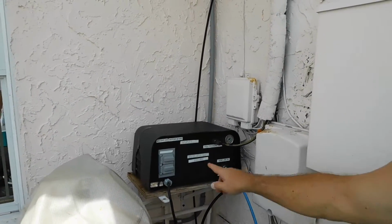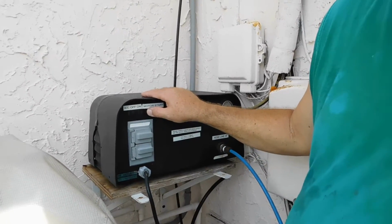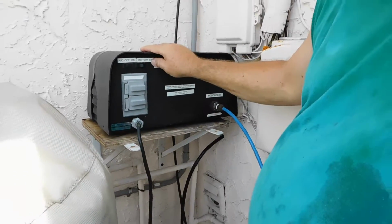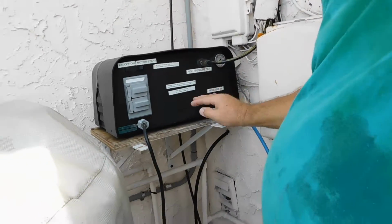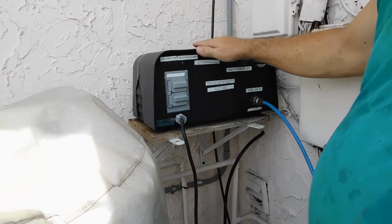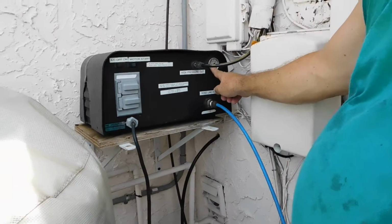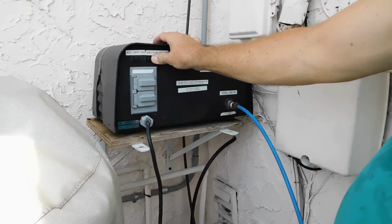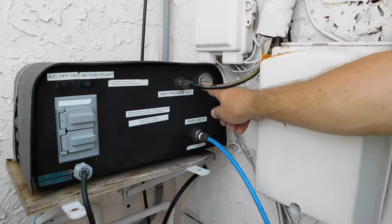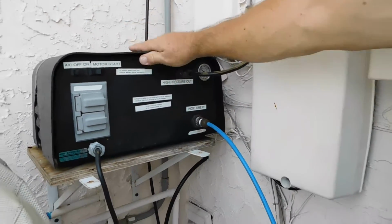Then we're going to hit the motor start, which basically checks for pressure. If you have hose pressure coming in, the motor will continue to work. Without hose pressure, it has a safety feature that turns off the motor. So we'll not allow this unit to be ran without hose pressure. So here we go, and here's the pressure gauge. You see the hose pressure gauge is building up to about 400 on up to 500 psi.